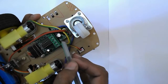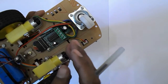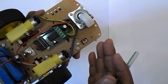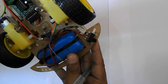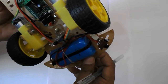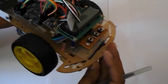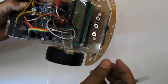To provide a constant power supply to these two DC motors, I am using a small buck converter. This buck converter converts the input voltage to 6 volts to provide constant power — otherwise the varying voltage affects the speed of the robot. I am also using a 7.4-volt LiPo battery with a 2200 mAh maximum current capacity.